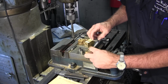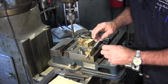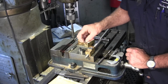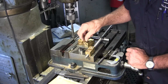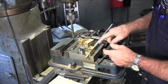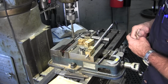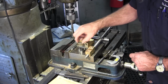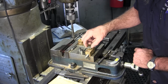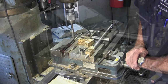We're going to be located down into the body of the block instead of pushing on the top surface and creating a twist in the tube. We're going to be pushing in a straight line with our set screws. That's a change of our design here. I'm going to finish up the other two blocks, and then we'll set up and start doing those two screws. When we eliminate this, we're going to be gaining a thread or an opening to be able to oil this lead screw, or this cross feed screw.